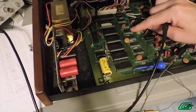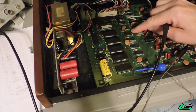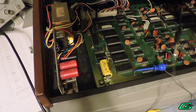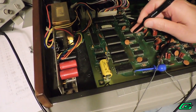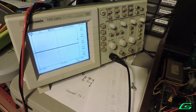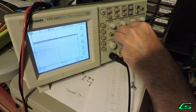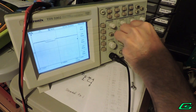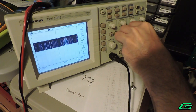A pair of chips are responsible for strobing data devices for when it's their turn to put data on the bus. One is a decoder chip and the other is a quad OR gate logic chip. Looking at the decoder chip on the scope, I find that 3 of the 4 lines are always high. Strobe R4 is high, strobe R3 is high, strobe R2 is high and also has a weird stepping signal going on. Strobe R1 looks a little better.